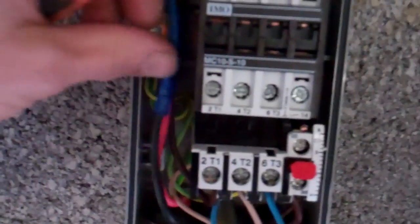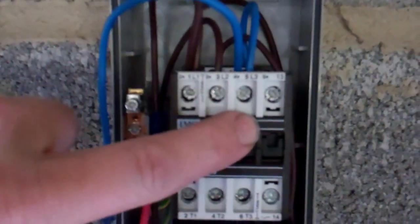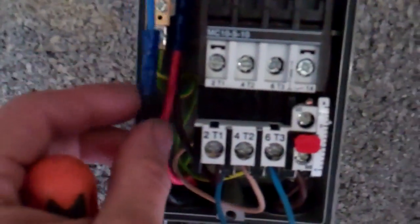Because these are designed for three phase, these are set for three amps roughly. You need amperage on each one of these legs, otherwise it assumes it's lost the phase and they'll trip after 30 seconds or so.